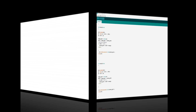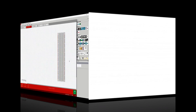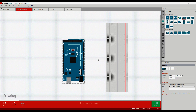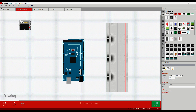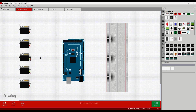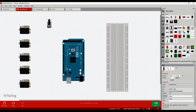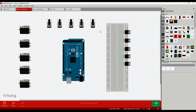Okay, now let's move to the circuit diagram. I define the circuit on breadboard — you can see it on screen. First the breadboard, then Arduino Mega, potentiometers, servos, and the main thing is IC 7805, which supplies 5 volts. You have to use five 7805 ICs for giving proper supply to all servo motors. Don't connect servo power directly to Arduino Mega.